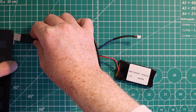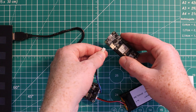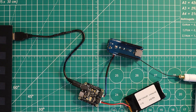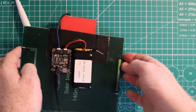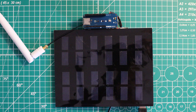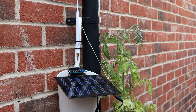The solar LiPo charger from Pimoroni also acts as a standard LiPo charger via its USB-C connector. We plug the solar panel into one side, the battery into the other, and the Cicerone board into the load connector. I 3D printed a simple board to mount the sensor to the outside of the solar panel. I mounted the battery and solar charger to the back of the panel using double-sided tape, left the antenna free to attach via a zip tie, then mounted the whole setup outside.